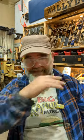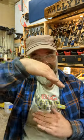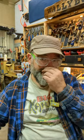As long as you stick with the basics and just think where that brace is pointing. If it's a low gate, you might only have two ledges. If it's a tall gate or door or whatever, you would have three ledges. But there's two ways of doing the braces. You can do what you call a through brace, like I've done on the barn doors, so the brace is in line with the top brace through the middle ledge to the bottom ledge. Or you can do it as a Z, so you've got two Zs that are staggered. So that's the other way of doing it. It's really up to you.